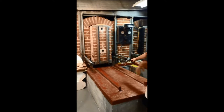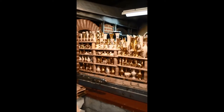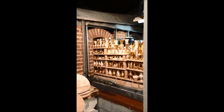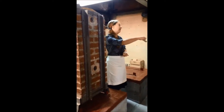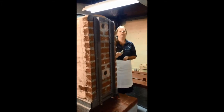Now I have a fired and finished kiln here. We have four gas kilns and four electric kilns. This is one of our gas kilns, and this was a gold firing — one of our prettiest firings, and you'll also notice it's really full. We like to get as much as we can in a kiln; we don't want to waste any space or any gas — we want to use every square inch. However, when firing the kiln, we have to be very careful that no two pieces touch. If any two pieces touch while they're in the kiln, they're going to be fused together forever. We had two pieces that got together in the firing — they are now best buds forever and will not come apart. So we would lose two pieces at the same time.